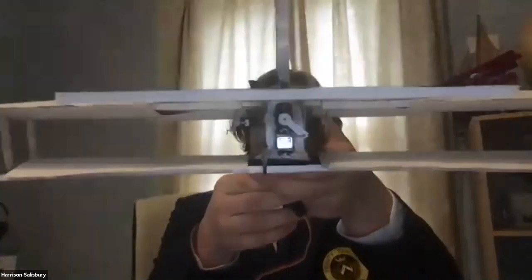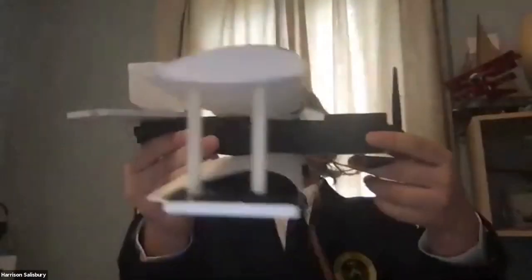And did you set the wings? They're not parallel to each other, are they? They are. Well, there's a little bit of a bow in them, but yeah. No, but when you go from the dowels, is it straight up, or is it like a biplane? The top wing will be a shade ahead of the lower wing. Oh, yeah. Why is that? It's for aerodynamic purposes. It helps with the uninterrupted airflow, I believe. Yeah, if you have them completely parallel, I think the bottom wing will stall much quicker. Yeah, it messes up the airflow, because the air can't get above it, probably.